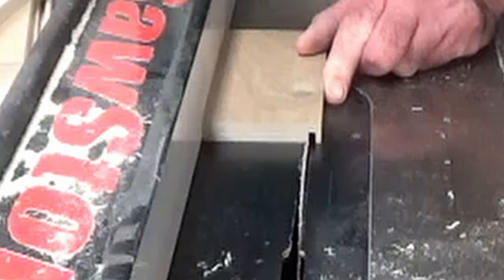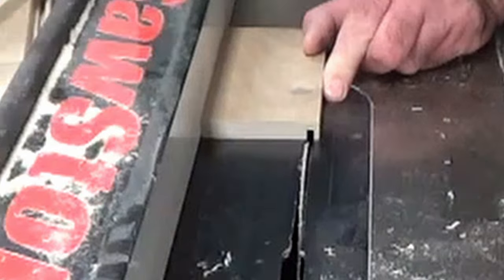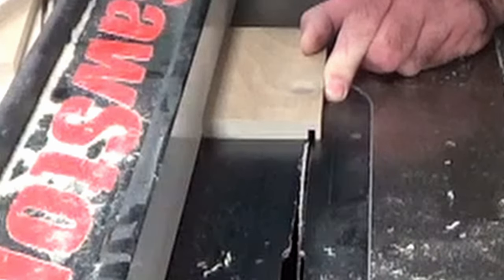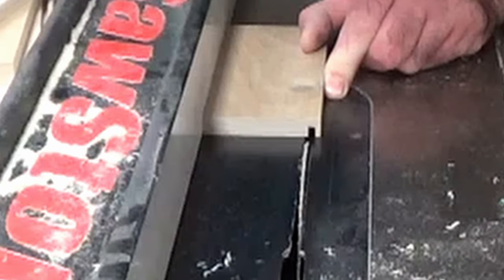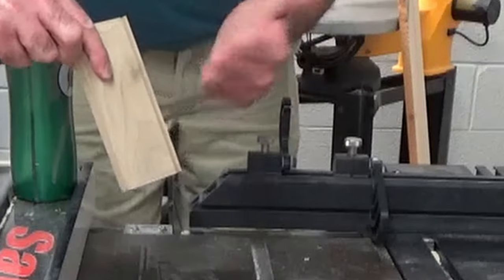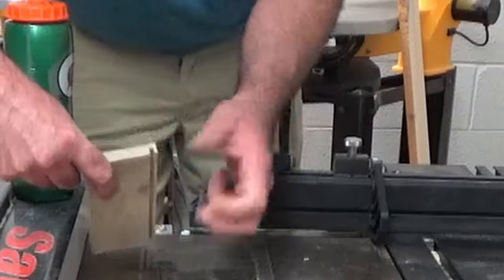If it is too small, you just have to move it again and make another cut. If you don't get it big enough, you just make another cut. It would be really hard to make it too big — even if you did three full blade widths on each cut, you are probably not going to be too big. Again, the cut groove should be facing out, away from the fence, with the groove on the other side.